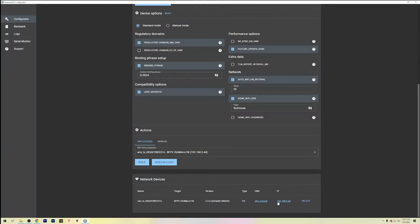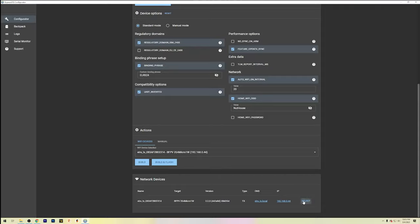Or you can always flash over USB — plug the cable in, flip the two switches, and you're good. The benefit of having it set to your home Wi-Fi is it now pops up as a local IP address. Here it's 192.168.0.44, logged into my home Wi-Fi. I can walk around my entire house and have a good connection to the internal module as long as I have decent Wi-Fi coverage. Then in the configurator, just hit select — it auto-fills everything and you're good to go.